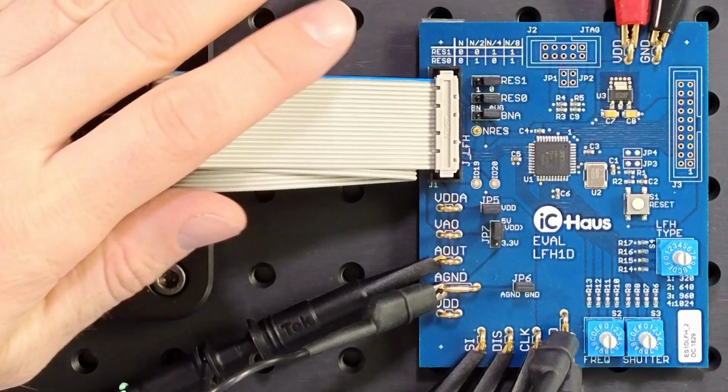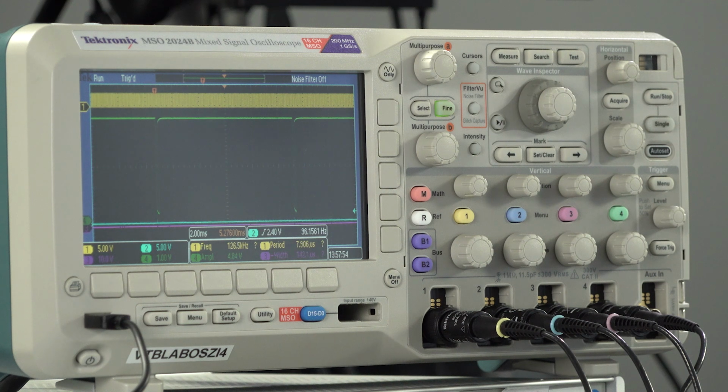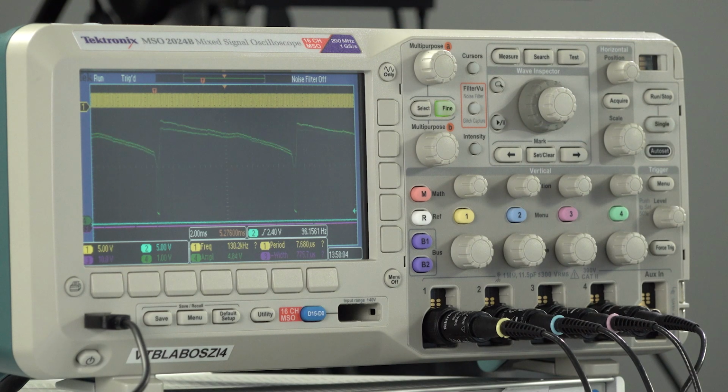With those general remarks out of the way, I can now tune the settings to get a usable signal that is not saturated. For a quick test, I can just cover the sensor with my hand to see if it reacts at all. Yes, the signal goes down for every pixel, and the different pixels measure different amounts of light. So the straight line from the brightness saturation becomes curvy. As I remove my hand again, the signal goes back to saturation.